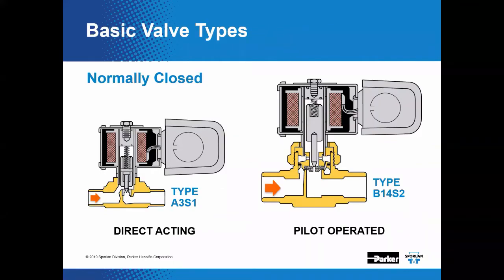Now, solenoid valves are electrically operated solenoid stop valves, and the plunger inside of these valves is pulled up by an electromagnetic force. So as you apply current through the coils, that creates a magnetic field, which will lift or lower a stem and plunger. Okay, so these valves will either be fully open or fully closed. Solenoid valves do not modulate flow, all right? So just think of it as an electrically operated ball valve, essentially.